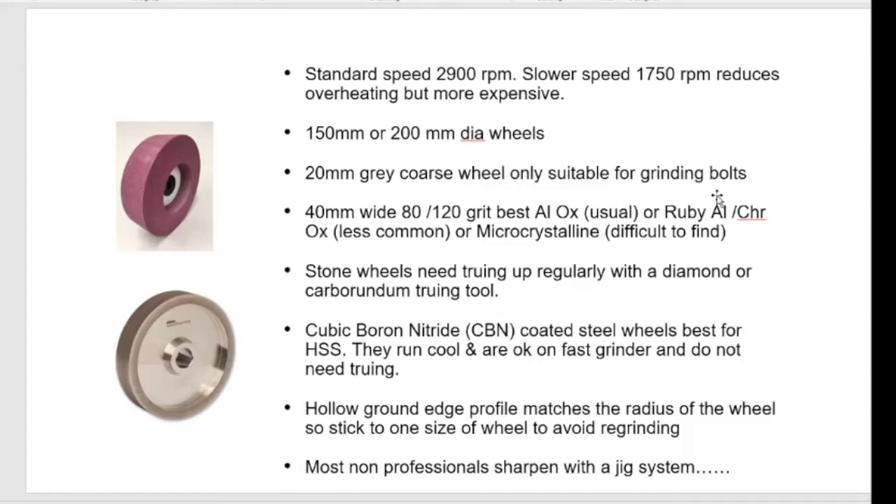I've only used the slower ones a couple of times and didn't notice a massive difference in functionality. The whole point about using a fast wheel is that it will tend to eat up the metal and can heat up the tip — which is only really a problem if you're sharpening carbon steel. If you're sharpening high speed steel, I don't think it's possible to reduce the hardening unless it glows to red heat. If you do blue a high speed steel tool it's not good practice but won't ruin it; if you blue a carbon steel one, all the strength in that area is gone.